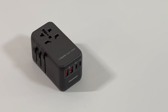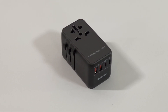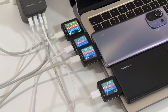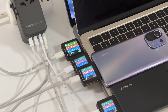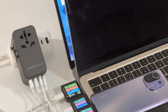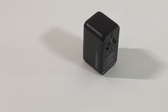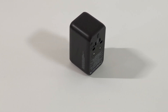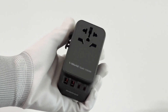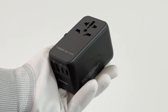That's all the tests for this 100W universal travel adapter from MoMAX. Unlike the 35W and 65W versions, the 100W maximum power and four USB ports allow you to fast-charge multiple devices simultaneously, even high-powered ones, anywhere worldwide. It performs well in standby power and conversion efficiency tests, but maximum temperature and ripple are not well controlled — just like the 35W and 65W versions. Don't forget to like, comment, and subscribe. See you in the next video!